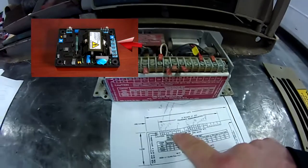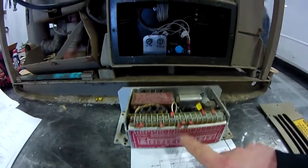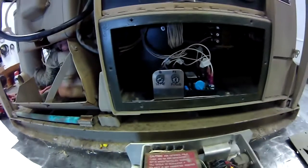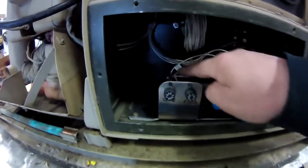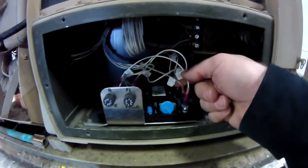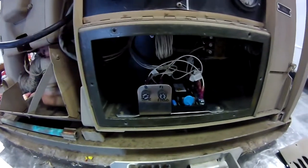And then wire 24 and wire 27 — pin one and two — those go to my pins seven and eight. So wire 24 and 27 are what we're looking for. Wire 27 comes to my fuse, so this is my sense line. And then my two lines come for 24 and 27, pins seven and eight — those go to the sense and the power input.